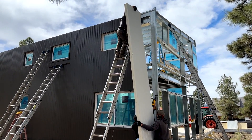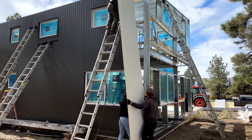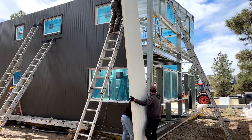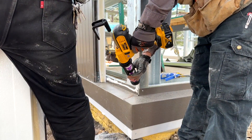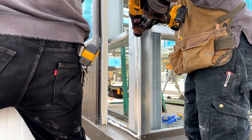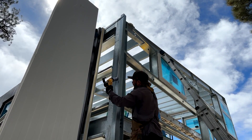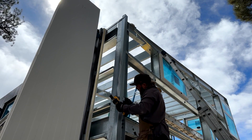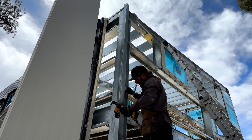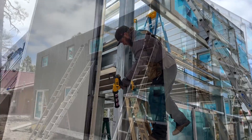This is the final panel being installed on the north wall of the Vesta. The first step before installing each panel is to caulk the interlocking seam of the panel. The battery-powered caulk gun is massively helpful during the IMP install process. The panels aren't very heavy but can be awkward because of their size. As this is an end panel, make sure to add caulk to the vertical framing column where the panel will end.